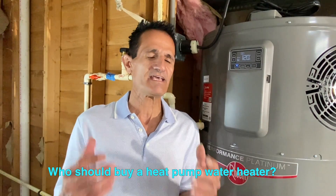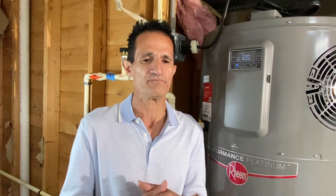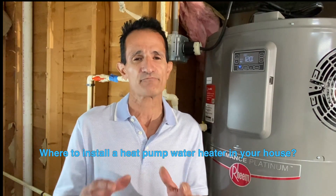This is more energy efficient than a normal electric or gas hot water heater. Who should buy a heat pump hot water heater? If you have high electric rates or moderate to high hot water use, a heat pump hot water heater is definitely worth considering. They work particularly well in mild to hot climates — if you have a hot garage or hot attic, it can use that ambient heat to heat your water and will also take heat and humidity out of the air, helping cool your home.